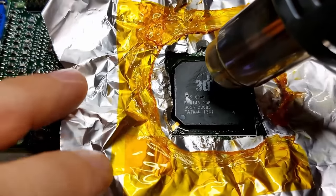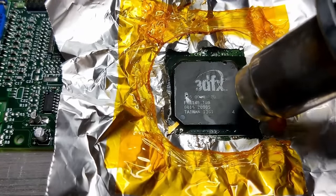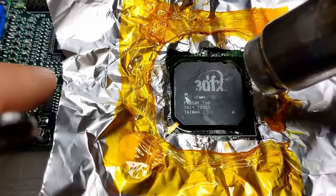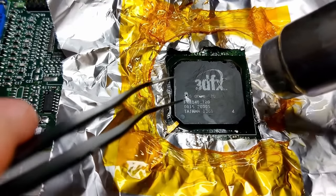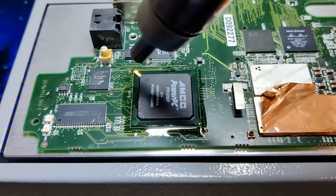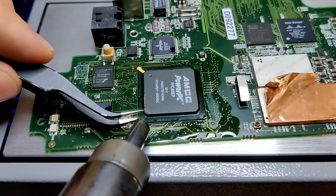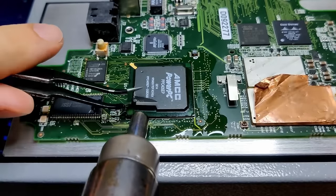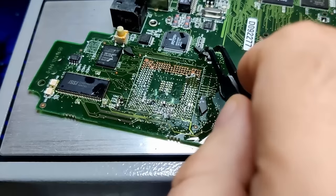I used a PCB pre-heater set to 120 degrees, covered some of the electrolytic capacitors with foil — which I replaced later on anyway — and blasted hot air at the chip. Unfortunately I have only a cheap hot air station, which I plan to replace soon. I removed the nozzle because the hot air station would be too weak otherwise. I tested this before on a different chip to practice. After 5 minutes of blasting hot air on it, I thought it had some sort of glue or underfill because it didn't move at all. So I used brute force to look at what was underneath my test chip, only to realize that there was nothing — just regular solder. This was the moment when I realized that I need a better hot air station.